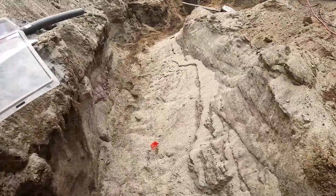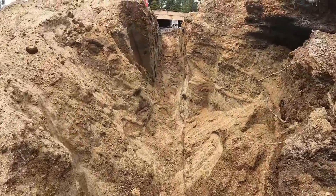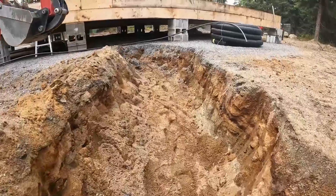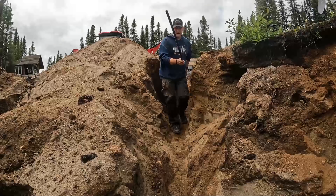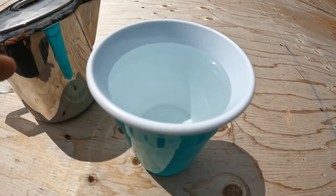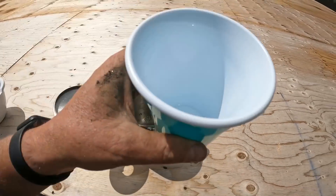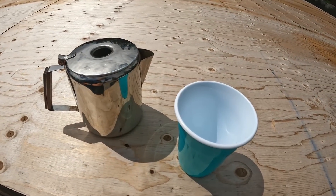Alright, it's time for a bit of fun science here now. The key is to make sure there are no low spots in this water line whatsoever. So I'm going to put my water pipe down and I'm going to put some water in the top foot - and I should get the exact same amount of water come out down the bottom. If I do, then I have no low spots. I've got this cup just about full, I'm going to pour it into my kettle so it's easier to pour into the pipe with the spout. I'm going to have my father hold the cup at the end of the pipe down there and I'll go ahead and pour it in.